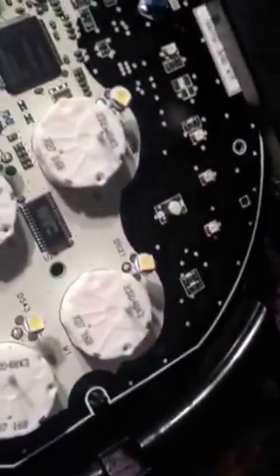This is post-rebuild and I have also swapped out all of the little bulbs for LED. It came with these little LED things that look like Christmas lights in the kit. It's kind of bogus on some of them because when they put it together they kind of glue this. This thing right here is kind of glued into the bulb. What I found best was to just take scissors and snip off the end. I just snipped off the end because you're going to clip it down anyway. I had a couple where it snapped off, and I was able to solder all the wires back on.